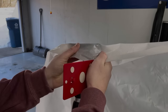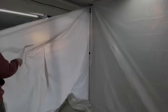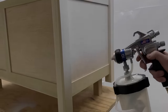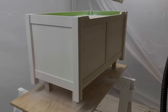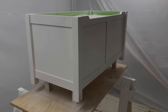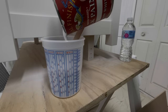For the finishing process I moved over to my home garage that stays heated and set up a spray shelter using this Zipwall product, which makes it so quick and easy. All the spraying was done with my Graco 9.5 HVLP, and I started with two coats of Zinsser BIN Primer, sanding with 220 grit between coats.